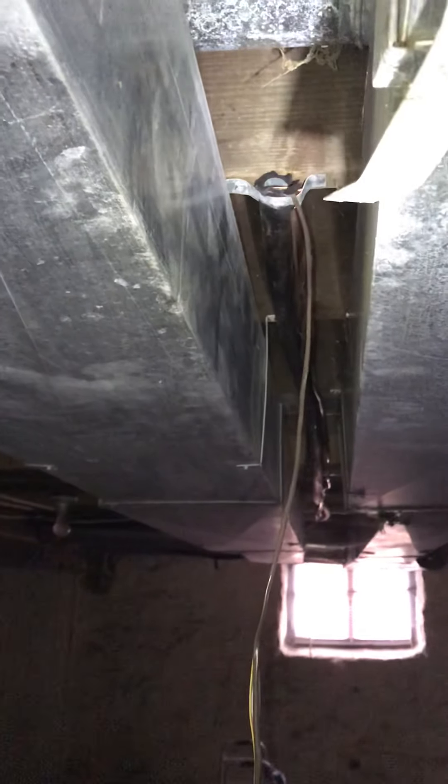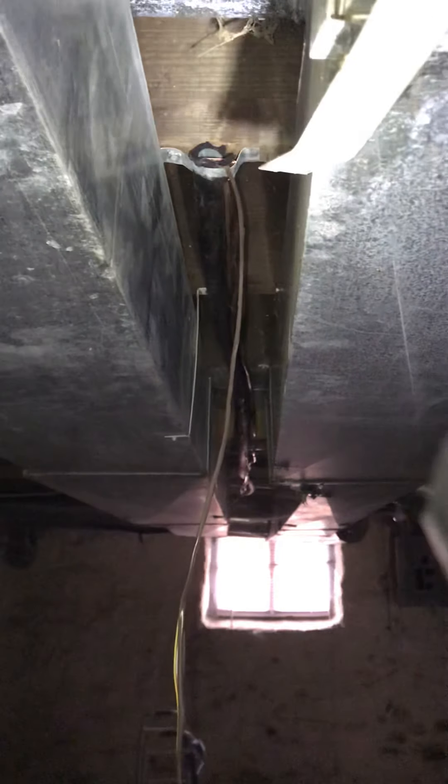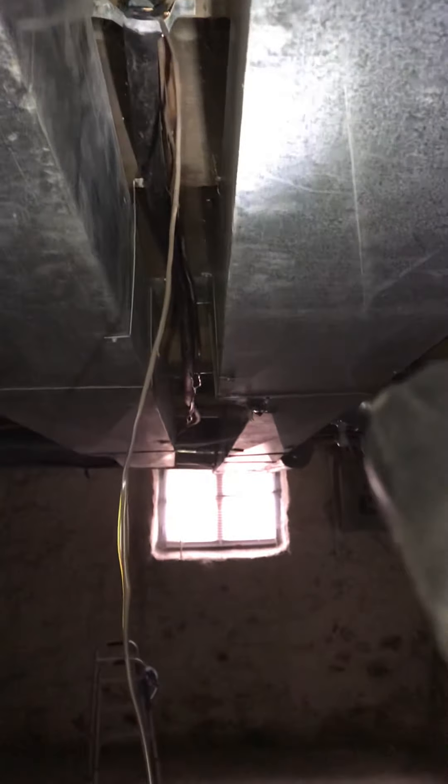As far as the drain and line set on this one, it's actually missing — they cut it off. You can see where they cut it off, right close to that furnace and AC that takes care of the first level. We should be able to hook on and just run it through — probably need about another 15 to 20 feet to reach it. The drain is at the back; that's where everything runs into. It is a walkout.